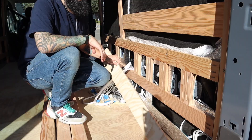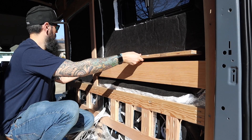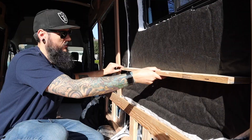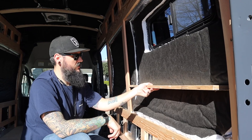I went and cut this one out of a piece of scrap ply. Basically I had to make it four and a half inches at this side and three and a half inches at this side, and it should sit perfectly right on top of that board. I have to cut another one just like this for the top that's going to go across, then cut out two sides, build a box, and attach it here. That should give us a nice box going into the wall as far as possible.